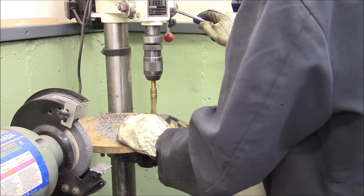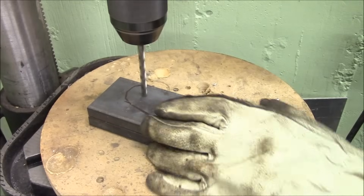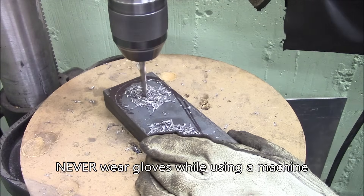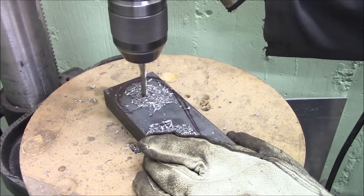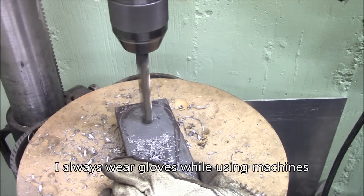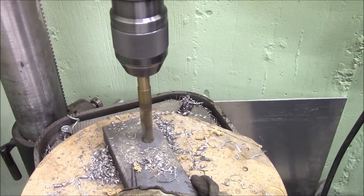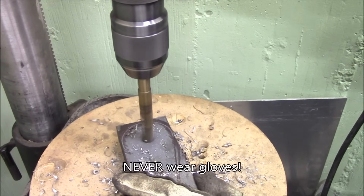With drilling you want to start with a pilot hole, work your way up to the big size. I've got a pretty cheap Princess Auto Deming drill set — they're just a half inch shank but they get bigger and bigger, and I ended up destroying two of my drills here because they just didn't like drilling. Could be my drill press doesn't go slow enough.